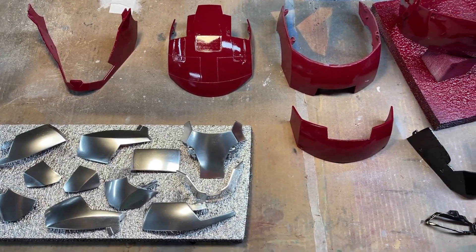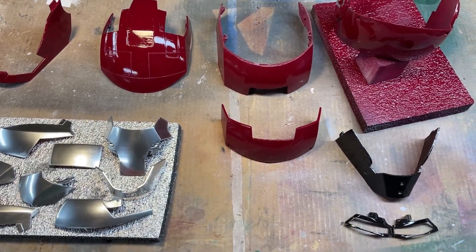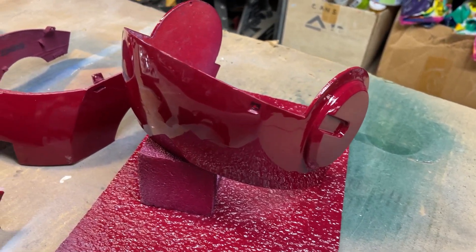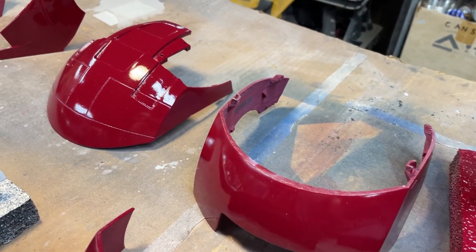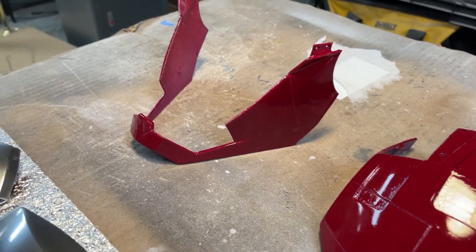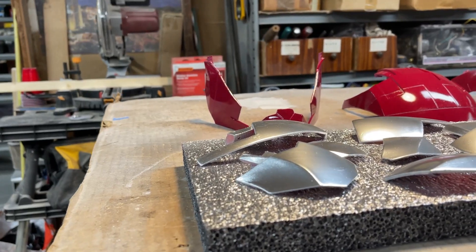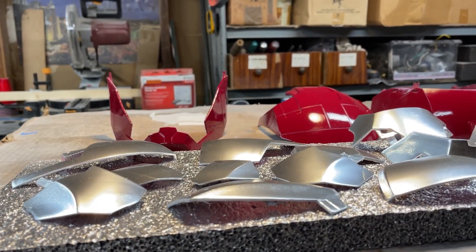As a side note, when using metallic silver paint, you shouldn't use a clear coat — a clear coat will dull the shine. A part that's being made glossy and shiny should be free of any lint and contaminants to keep imperfections from killing the illusion. I wiped down all of my parts with mineral spirits and a microfiber cloth, but after spraying the paint, the fan from the fume exhaust suddenly decided to pull in a sandstorm and coated my parts in dust.